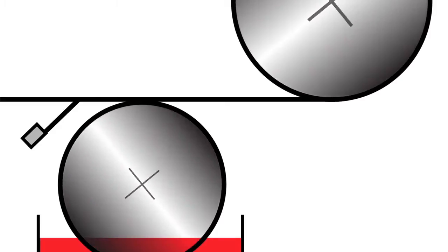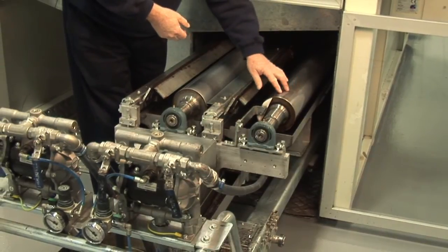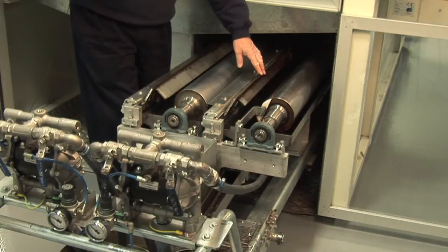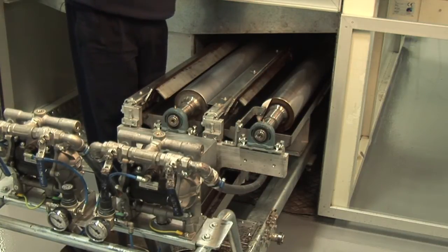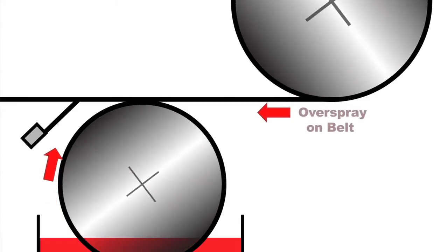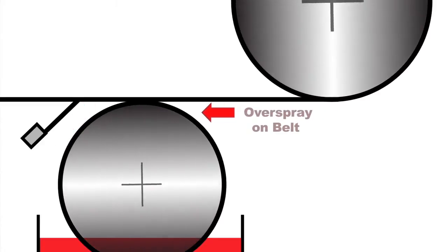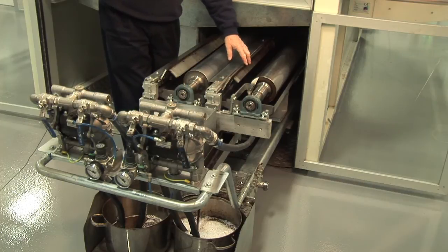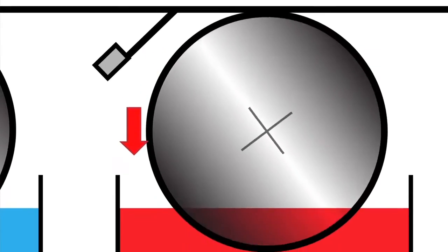The surface of the roller has very, very fine texturing — not enough to damage the face of the belt, but enough so that when we bring the wet material up, we make it mingle with the overspray. So now the belt is covered in a homogenous mass of coating. That allows us then to use just the one scraper blade to remove all of the coating and put it back to the trough.